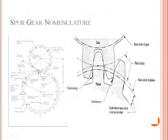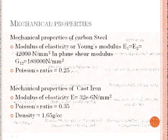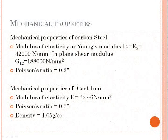Unexpected environmental conditions affecting gear drive performance can be grouped into 3 categories: ambient temperature, either high or low; airborne abrasive material; and corrosive materials of gaseous, liquid or solid form. Gear distress and failure modes: distress or failure of gears may be classified into 4 categories: surface fatigue, pitting, wear, plastic flow, and breakage. These differences result from the different physical characteristics and properties and from the residual stress characteristics associated with the surface hardened gearing.